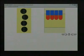And what I was trying to demonstrate, I don't know if you can see these jiggling. Most people imagine that if you try to turn the plug with no key in it, all those pins, those drivers must be bumping against the shear line edge. And that's not really the case. Because these are all out of order, all sort of wobbly and not perfectly drilled, at any given time, if you try to twist that plug, only one pin stack will ever really be binding. And you can see in this particular hypothetical, this pin stack's furthest over, so that's the one that's hitting at the moment. These are just kind of hanging out, just sitting there. This imperfection is what makes picking very, very possible because it allows us to isolate one pin stack at a time. It allows us to try to manipulate the pins in ways they weren't supposed to be used, and you can set pins, and that's what we're going to demonstrate now.